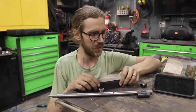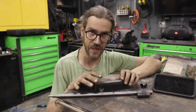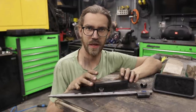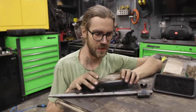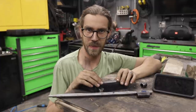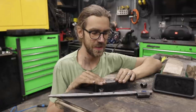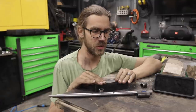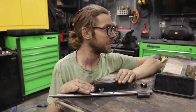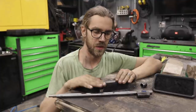Typically with engineering, you do not wanna make too many small moving pieces close together in one part, because it can basically create a lot of unnecessary slop and movement, especially when you're trying to make one piece do double duty. Keeping it simple is generally better in terms of design, if possible. In this case, that's not going to be possible, so I'm gonna be doing my own custom hinge here just to minimize slop.